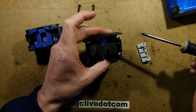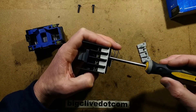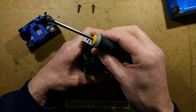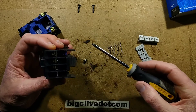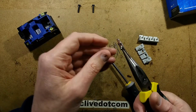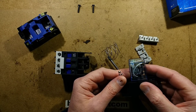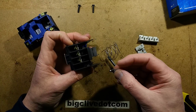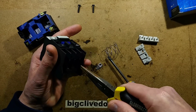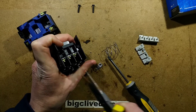Let's see if these contacts will come out. That bit pops out as well, and that will theoretically let these contacts pop out. Using long-nose pliers — the contacts aren't super large, actually very similar to those in a little relay. But they will be slammed together with considerably more force, it being a contactor. If I pull all these out, you could remove the whole plunger — let's see how the whole thing is constructed.